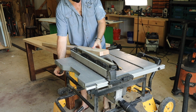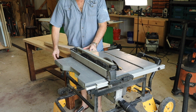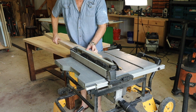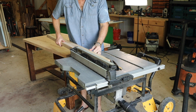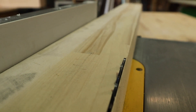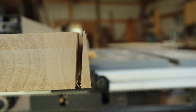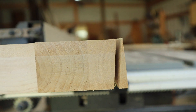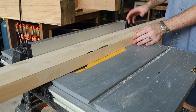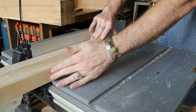What you want to do is essentially test bump your cut so the blade is just coming through, leaving you with anywhere from an eighth to a 32nd of tip of that wedge on the wood. The first cut should leave you with just a little sliver of wood, and at the very end you've made a perfect wedge shape. You can cut your wedges larger or bigger depending on the gap or crack you're attempting to fill, and you can cut as many as you need.